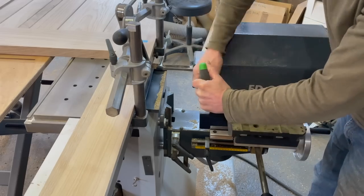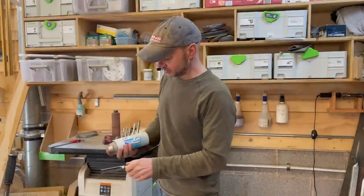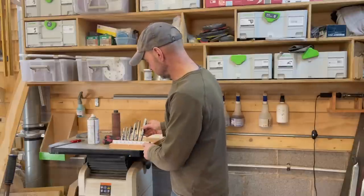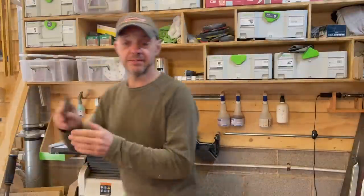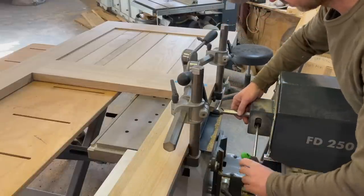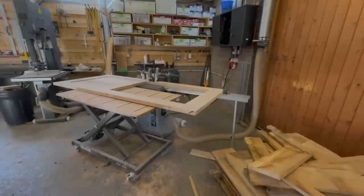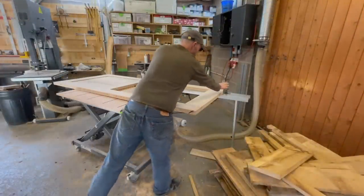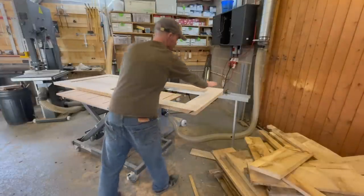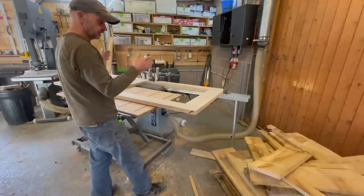With the round tool on, you just need an allen wrench to pull it off. You might see me spraying — that's just some dry lubricant. These cutters are quite expensive and get quite hot, especially in oak. That's the 18mm and I'm going up to the 20mm to do the other side of the lock. My stop here is from one of the Brewster stop sets and it just clips onto the extension — I can push the top of the door against it, so when I come to cut the other side of the lock it gives me my alignment.